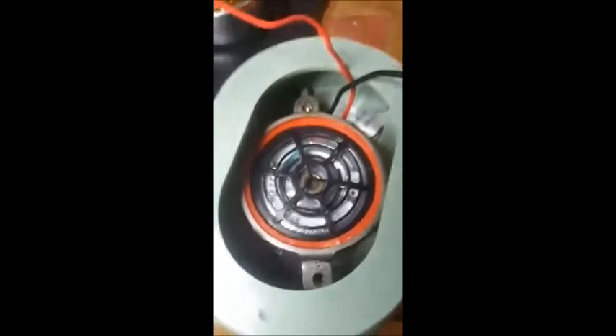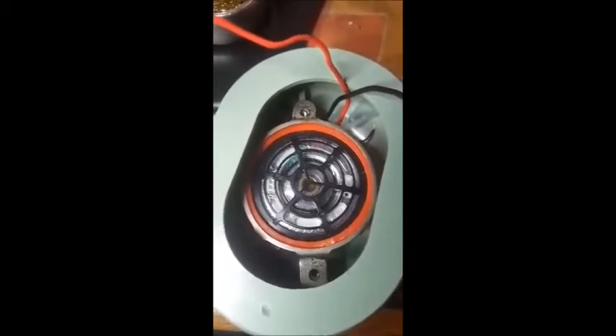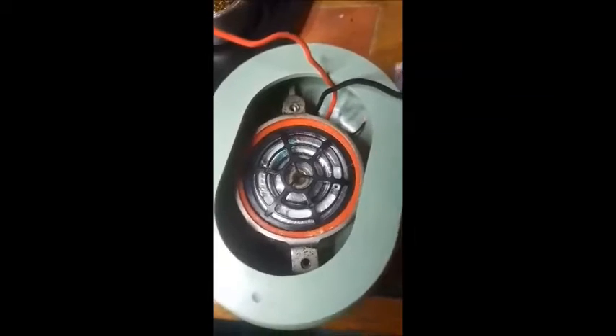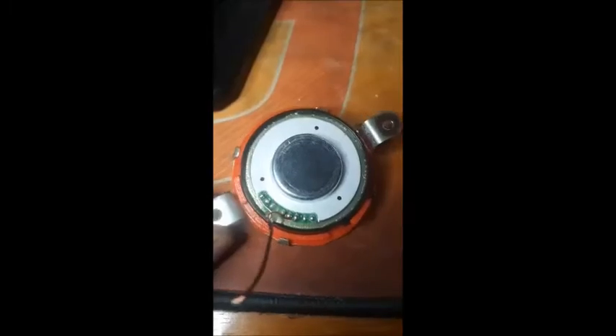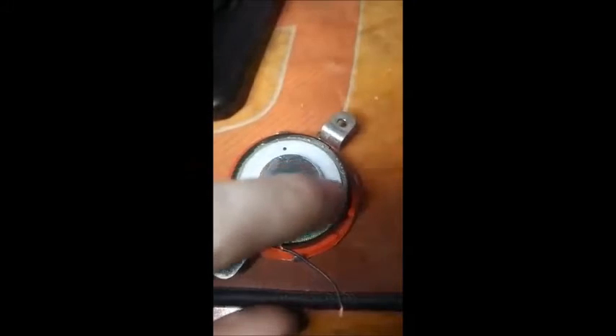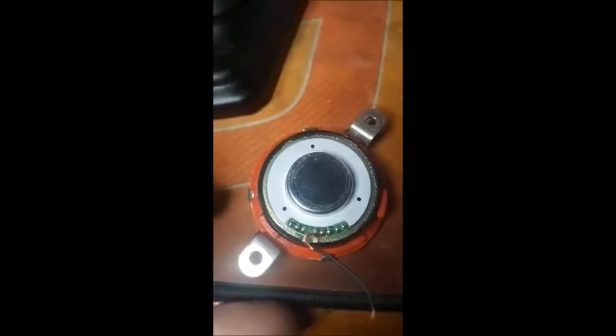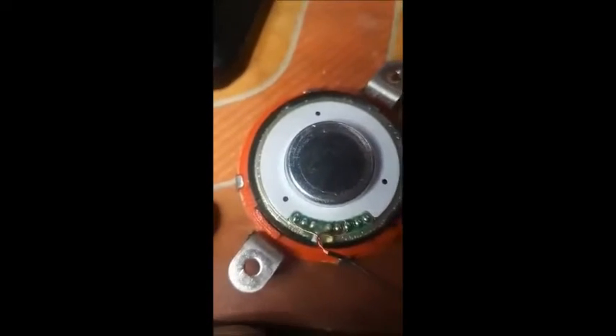This is what she looks like with the battery underneath - you can kind of see in there with the adapter I made for the speaker so it'll fit in the little housing. I also need to fit the electronics on the other side. Here's the second iteration - little clips underneath so you put it down and twist and it's locked in place. Unfortunately the clip mechanism is every 120 degrees but the clamping is every 90 degrees, so they kind of overlap.